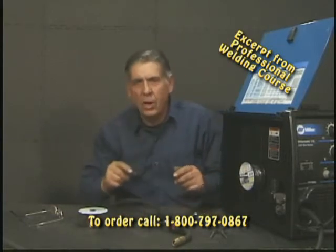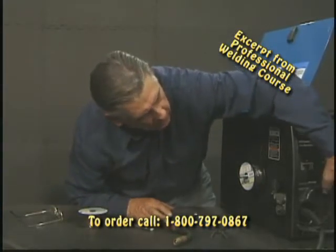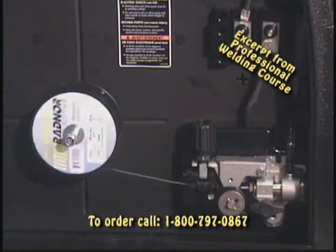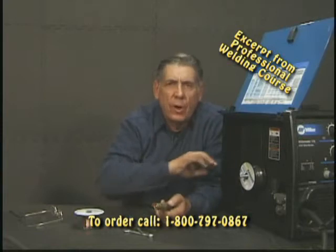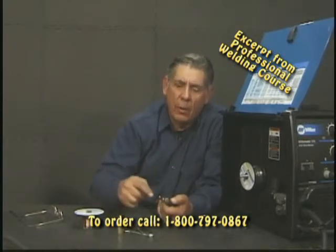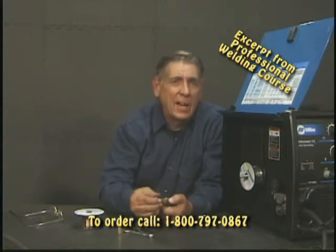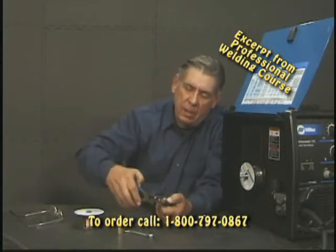I'm going to turn the machine on — I've plugged myself back in. Then I'm going to turn the wire feed on; I want a nice big loop in the wire. Once I've got some wire fed into the liner, I'm going to take my nozzle off. I don't want to run the wire all the way up because it'll hit the inside of the tip — maybe it'll come through 99% of the time, but if it doesn't it'll bird nest the wire and just stop it. So let me take my tip off.